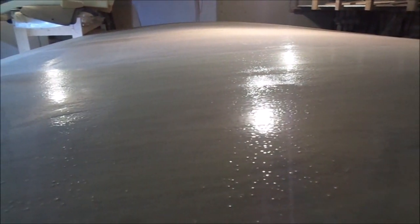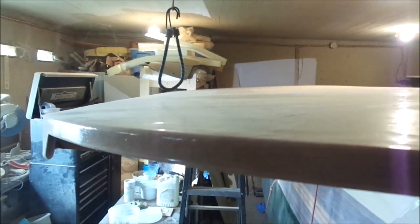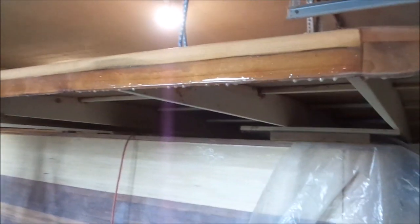I have the canopy shifted over about three feet, which will allow me to get underneath to do some work and finish it off. I need to do filleting along these stringers and sanding. This is the finished job of the canopy — the glassing and epoxying. I still have to sand it down and then varnish it, but it is complete. Here is the cherry trim along the front. I've added some little trim pieces to the side, and the edging is epoxied — it still needs to be sanded.